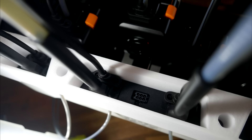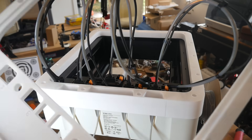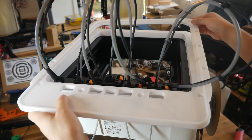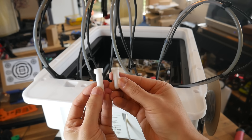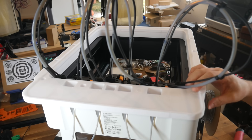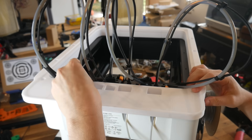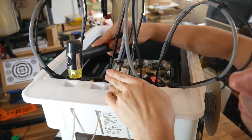Looking from the top, we can see there's still enough room for the tool connectors and the future expansion ports, and at the front there are cutouts to not obscure the Snapmaker logo or the touchscreen. The next step is to lower the second piece from above, once again clearing the umbilicals, placing it roughly in position, and then preparing the connecting pins — of which there are two versions. Referencing the diagram on Maker World, the ones with the skinny top go along the back and on the opposing front corners. Some needed a tap with the mallet to get the head all the way down.